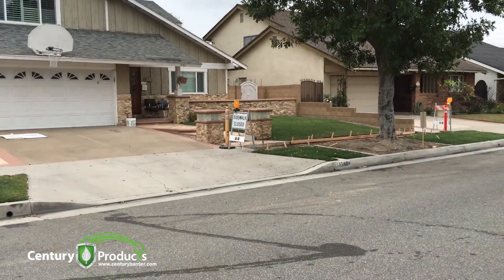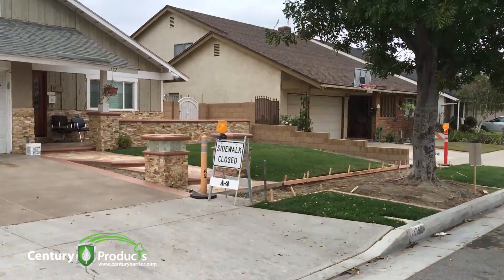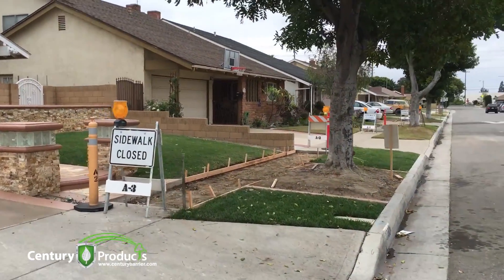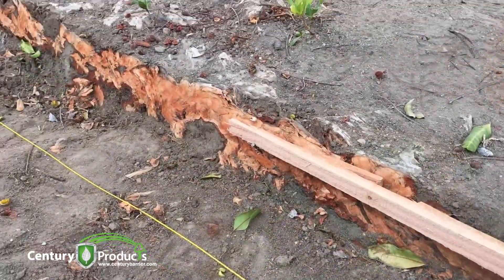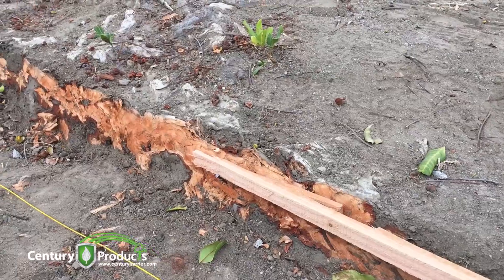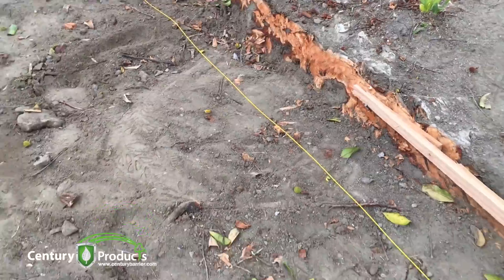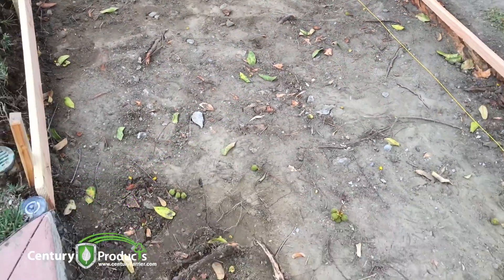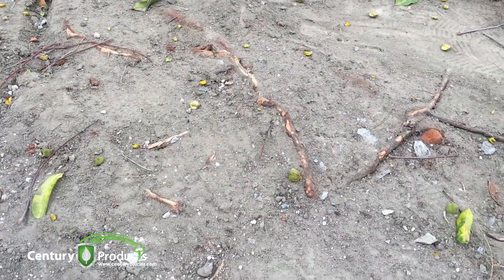This is one of a hundred locations on Hallbrook — address 1752 — where trees alongside the sidewalk have had aggressive roots pick up the sidewalk. The root mass has just been cut right here along the form, and we should be dropping in a root barrier to keep the tree roots from coming back underneath the concrete and picking up the new cement.